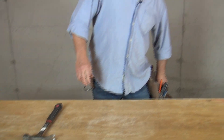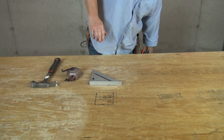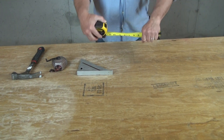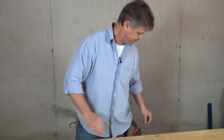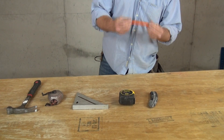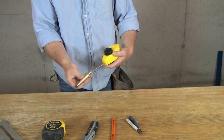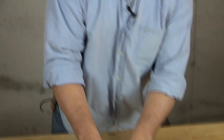Let's pull out what we've got: the hammer, a chalk box, my speed square — some might call this a rafter square — my trusty FatMax 30-foot tape measure. You could get a 25-foot FatMax; I love FatMax, best tapes on the market, one-inch thick blade. Make sure you have a good professional tape measure. I've also got my utility blade, a carpenter pencil — not a regular number two school pencil, a carpenter pencil — and a pair of punches. During the framing stage I also carry my plumb bob, a brass one attached to a chalk box to reel it back in.